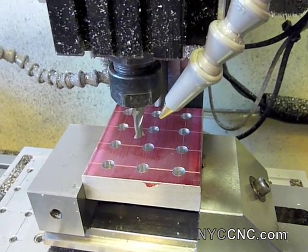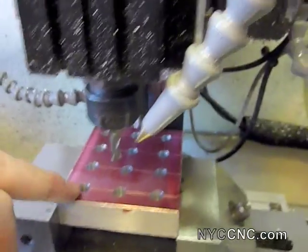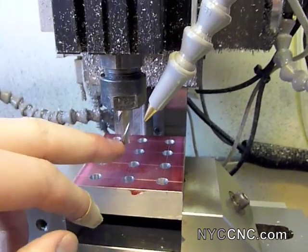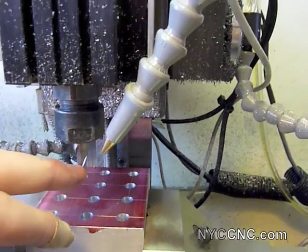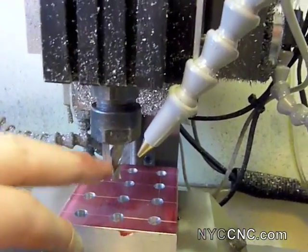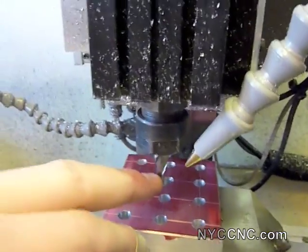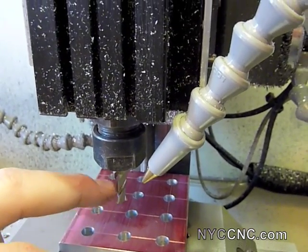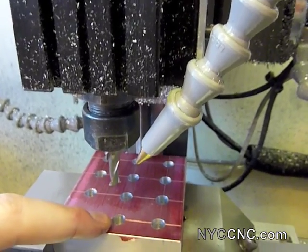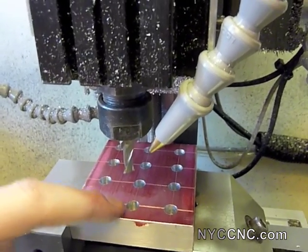I'm ready to mill. I've got the holes drilled out to 5/16ths, which gives me plenty of clearance to plunge a quarter-inch end mill. This is a two-flute OSG high-speed steel end mill — it's a pretty high-quality one. I'm going to be spinning it at 5,700 RPMs at about 10 inches a minute, which is a little under a thou chip load per tooth, and then I will be taking about a 35 thou depth of cut on each pass.